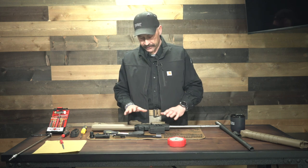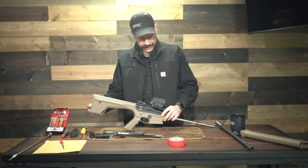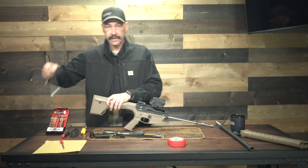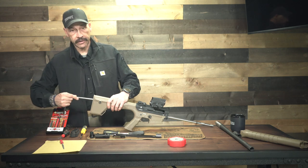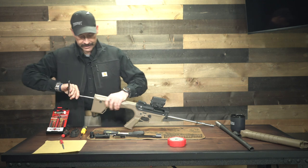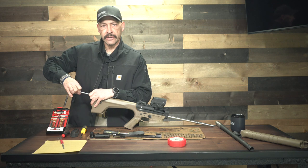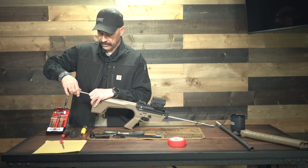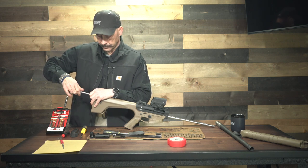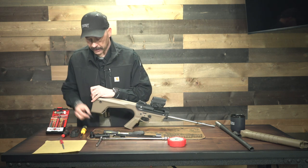To get into the lower portion of this gun you've got to put your extension rod all the way in to the back side — there's an allen screw in there, and I'll get a close-up of that. Righty tighty, lefty loosey — it just breaks loose and it's not a real long screw, so a few turns once you've broken it loose and it's going to want to come out. There it is, and there's a little metal plate with it.